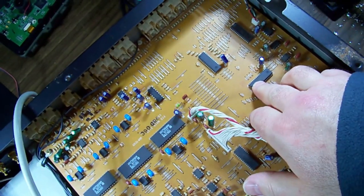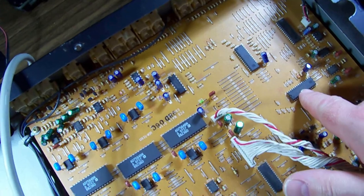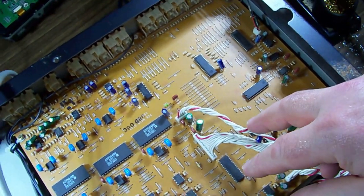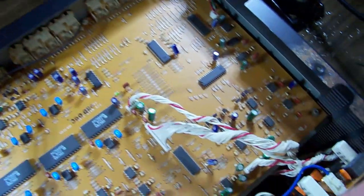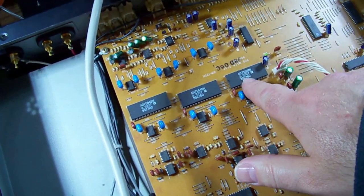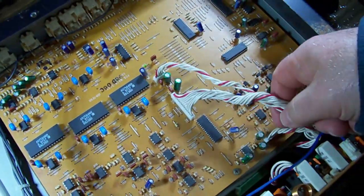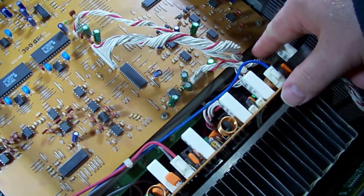Having a quick look at what these chips do before ripping everything apart. We have LC78221, LC78213, LC78212 - those are just switches, being used to select which input source is going through. There are a bunch of eight-pin ICs or op amps, and these AD7564B are digital to analog converters. All the wiring to this board appears to come from another board underneath, with the front panel connecting to that board too.